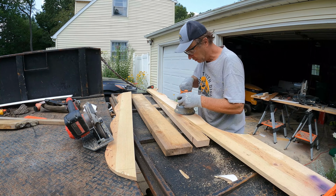So I mudded this in, I'm gonna give it a sanding. And I'm also thinking about maybe trimming that out with that crown molding. See what I got left over from the rest of it. May as well use it up. Might look nice in there. All right, we'll get everything put together. Transition pieces in. Crown molding in place. Put the little returns on it. Looks pretty good. That ceiling got some wave to it.